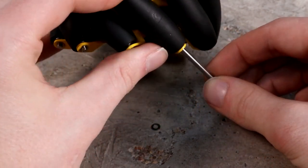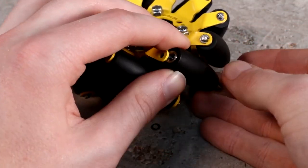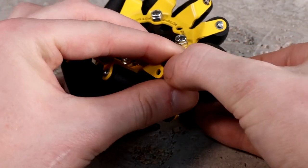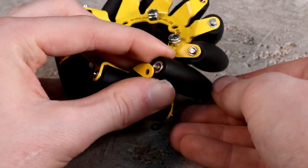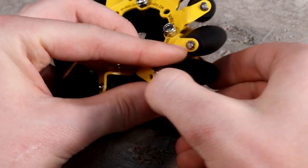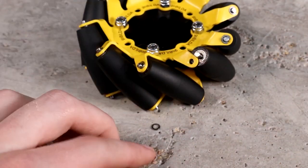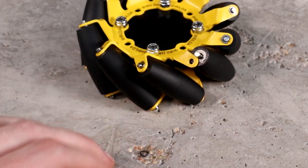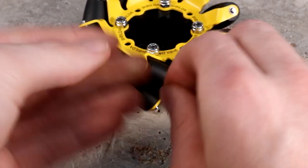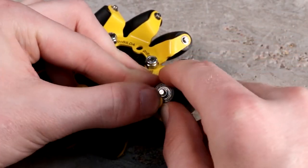Back the shaft up so you can get it onto the roller, then intentionally misalign the entire roller assembly as you push the whole shaft through — you can get it to poke up beside the plate. Add the shim while the shaft is popped up beside the plate instead of through the hole. Find your other shim and add it to the shaft as well, making sure not to get it stuck on the e-clip ring.